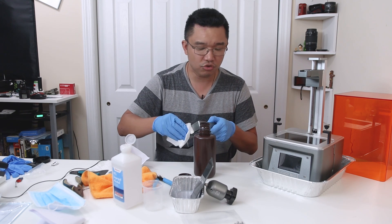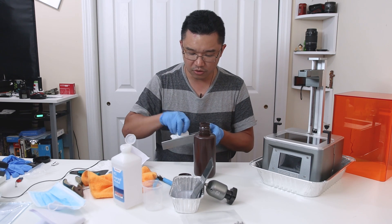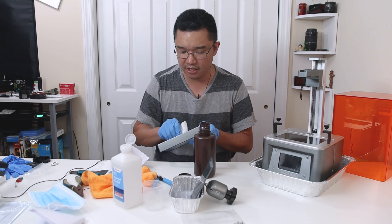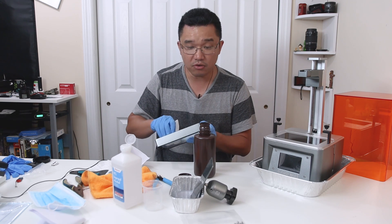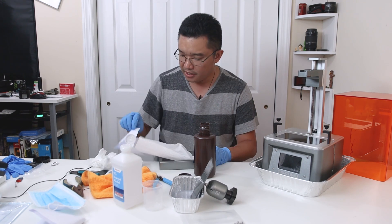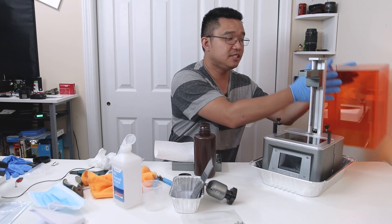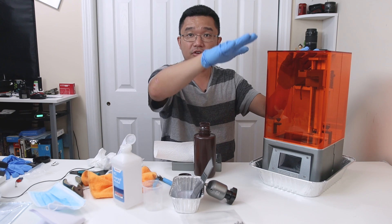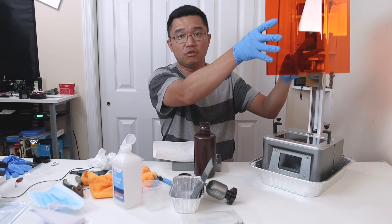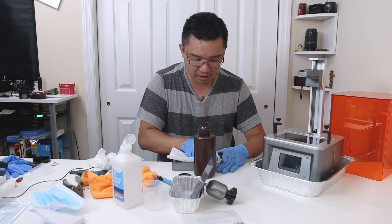If you notice, I'm using a tray — a tip I picked up from Sexy Cyborg and Maker Muse. They use a tray to keep the resin liquid contained so it doesn't go all over the place. Another thing: don't use latex gloves. Use nitrile gloves instead — I'll put the word up on screen. The resin and alcohol will eat through latex and you won't even feel it happening. Nitrile at least has a slower permeation rate. One particular thing I'm not a fan of is this lid. Other printers have lids that open from the front or flip up from the side. With this lift-off lid, if you put it on a shelf you need at least double the printer's height clearance above it just to remove the lid — a different opening mechanism would have been a better design.